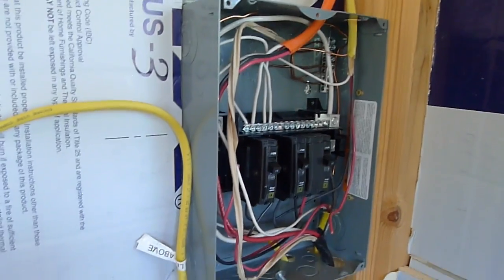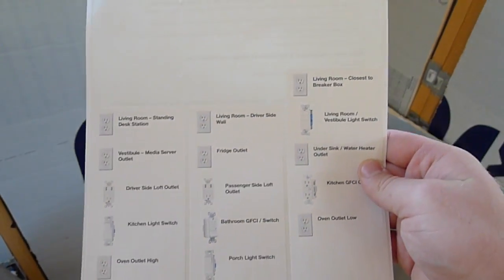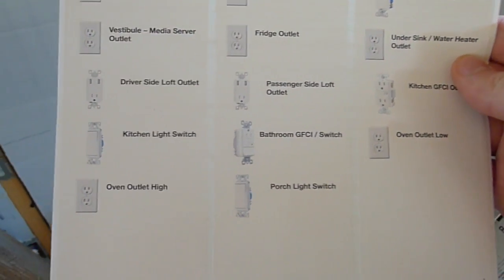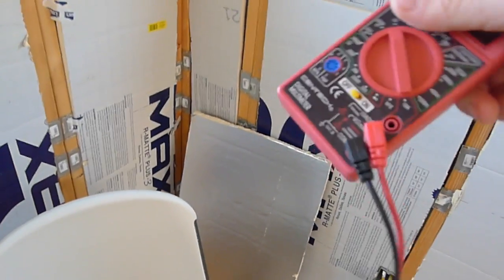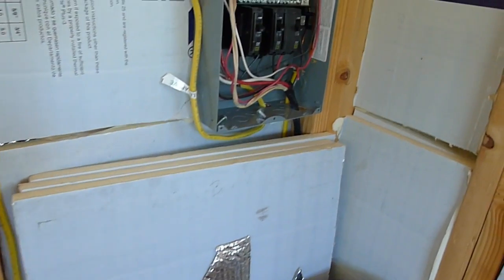Today I'm going to be doing something that I really don't want to do. I'm going to be testing the continuity of the wires in this house so that I can remove all of the outlets from each of their electrical boxes and put them in some sort of storage container. I will be labeling them with this beautiful sheet of sticker labels I created with pictures and everything because I have crazy OCD. And once I take them out, I will be wire capping the hot and neutral lines together and testing the continuity back at the circuit breaker on each circuit that comes in here.